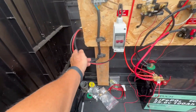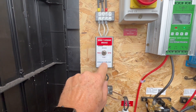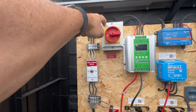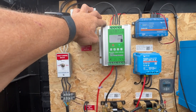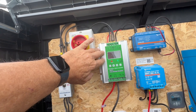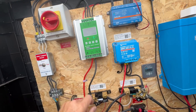Wind is coming in through here — this is your three-core cable going into a Missouri brake/spin/run switch system. Pretty good, very robust piece of equipment from them. Then just through an isolator so I can isolate that if I need to. From the isolator I'm using one of these Chinese-made units — it's actually wind and solar, I could have connected the solar up here, but I don't trust them as much as the Victron, so I'm just using this for wind. It hasn't been fully set up yet, so I haven't gone into the settings — but that will be the charge controller for the wind.